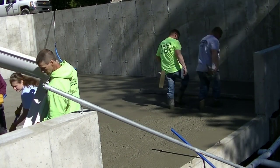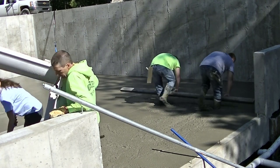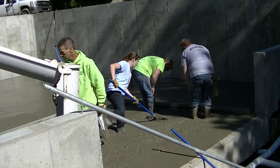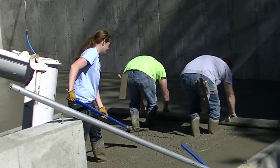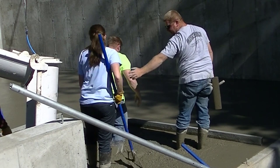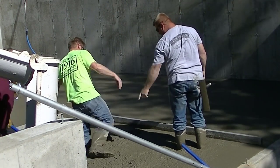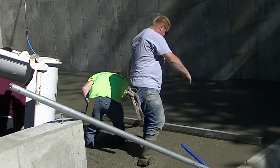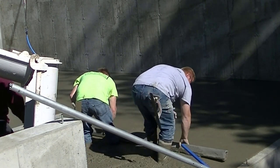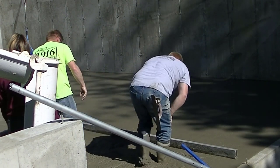You can see how it comes out of the chute and hits that end piece, and I can move the chute back and forth because it's hanging on those nubs kind of like a hinge — it just makes pouring right over the wall a lot easier, and you could do it for footings too. There's a deep beam in the middle of this floor — we call it a haunch — and it's almost as tall as our boots. When screeding through something like that you have to go nice and slow, because it tends to sag if you go too fast or bulge up and create a hump.